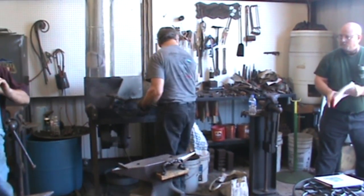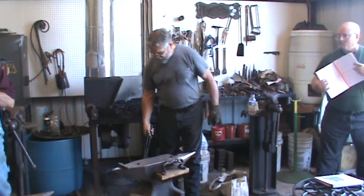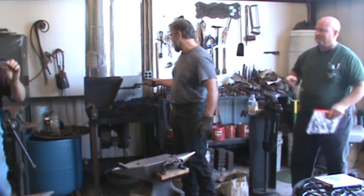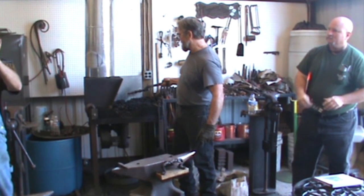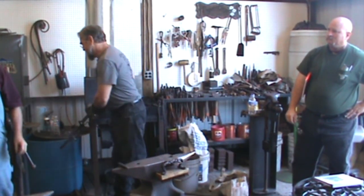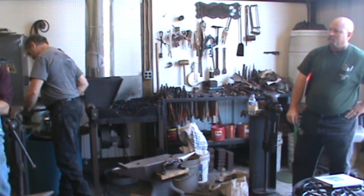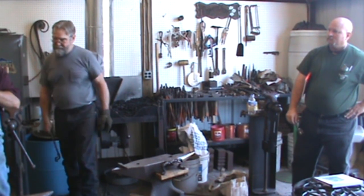Facebook page that I have. Some of you want to know how I did that flower. It's top secret, so if I show you, you have to promise not to share that secret. Cut little slices of stainless steel round bar, about 1/8 inch thick, and I used this stamp to stamp it out, just like that. Placed it on here and welded it on the backside with a TIG welder.